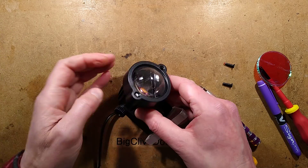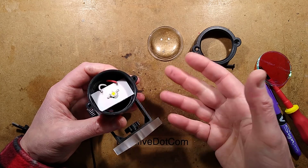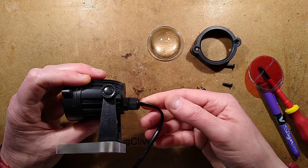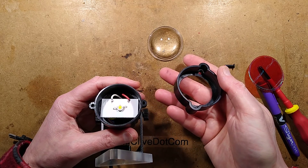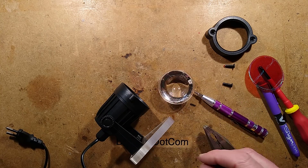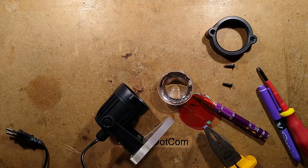So that's more or less it. It's very simple construction — this big plastic lens in the front with a standard 3W LED. It pressed in firmly and pretty much self-aligned itself, bang in the centre, which is ideal. It's got a little standard power supply. It does appear to have a suitable gland in the back, though it's got a flat cable going through a round gland — so maybe not suitable for outdoor use. This is also not waterproof, so it's definitely not suitable for outdoor use unless you had some sort of seal. It's just a little projector with a fixed colour determined by this dichroic filter that casts a fairly random pattern of colour onto the wall — quite a good visual effect.